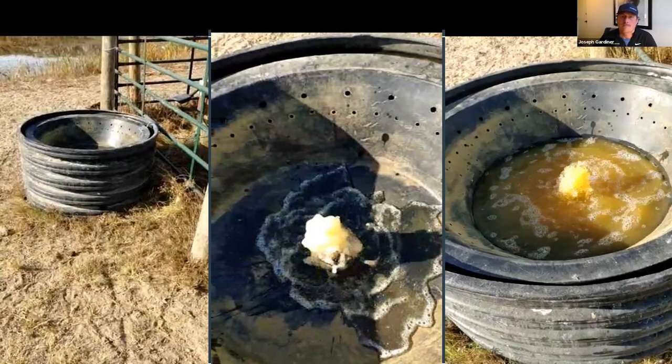Behind the panels there's a battery box. When you buy complete systems they come with a plastic box, but Phil has switched to a wood box with a hinged lid, insulated with two-inch foam insulation inside, bigger than required, to keep batteries as warm as possible at minus 40. His biggest nemesis is mice - they crawl along the wires and get inside the warm box in wintertime. He now stuffs steel wool in any hole where wiring or pipes enter, and that helps a lot. Poison would probably also work.